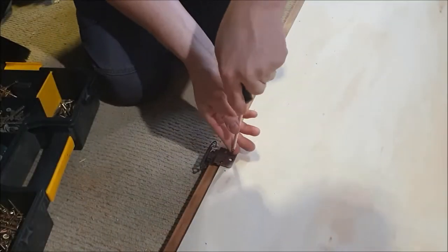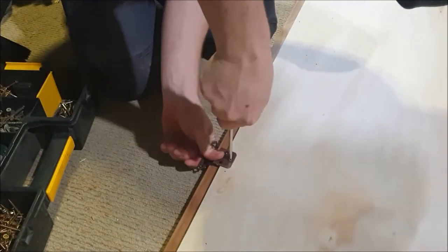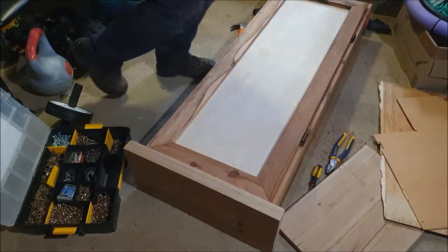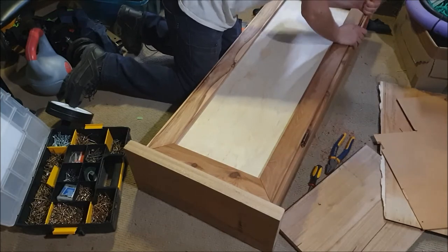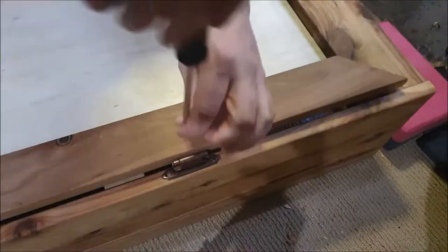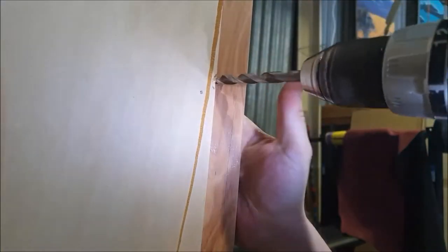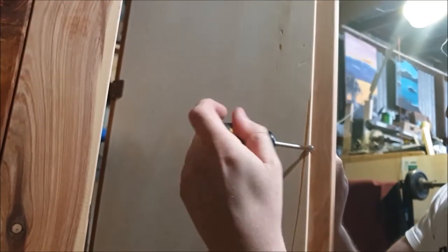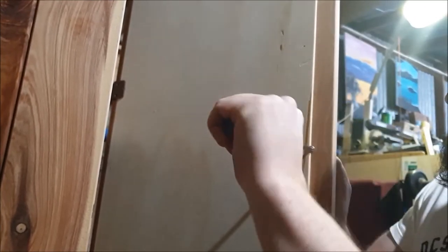This was the handle and the hinges that I wanted to use — they were just what I was looking for. They were the right colour to match the aesthetic of the cabinet. The hinges were a slim profile so they could just be screwed straight into the side. The handle was the right shape, just a little bit of charm without taking away from the main piece. I did have to drill a section out from the back though, where the handle came through right on the edge of the plywood. Once I cleared a little section away there, the screw went in, held secure, and the handle works fine.